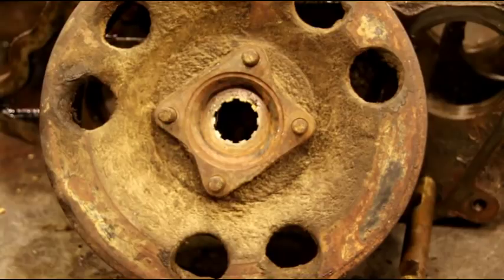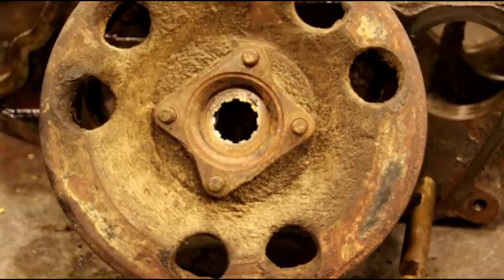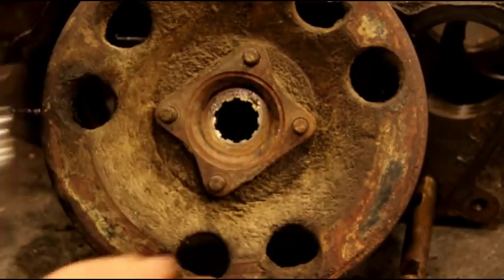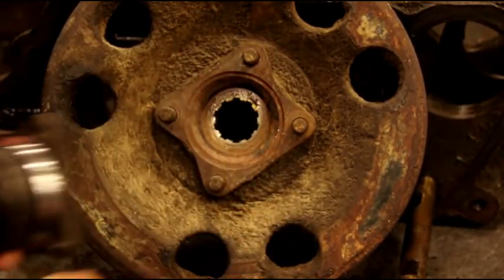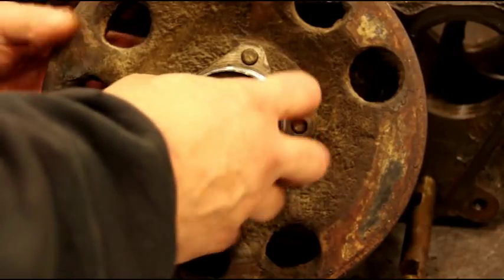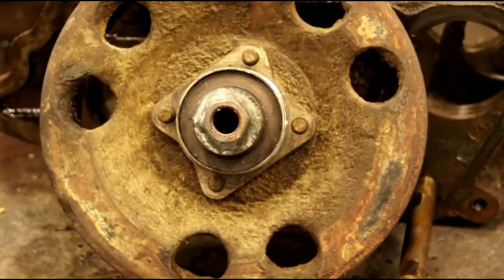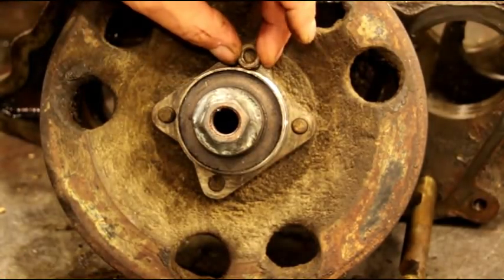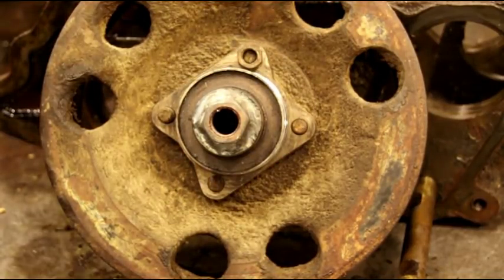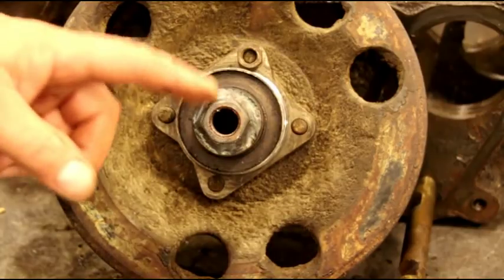What I was doing over in the lathe — I was relieving this flange. This is just an old one out of a busted-up transfer case. I was relieving this area so I can get a nut in there, and now a nut will fit in there. I took an old one of these and that's going to go on there — make sure you can see that — and then you'll put your nuts back on. I made this out of stuff I had laying around, nothing special. I turned it in the lathe to fit the nut and welded a nut on this side.